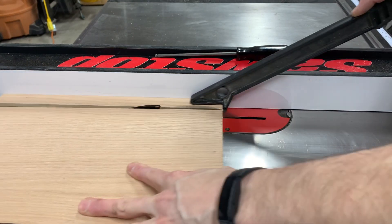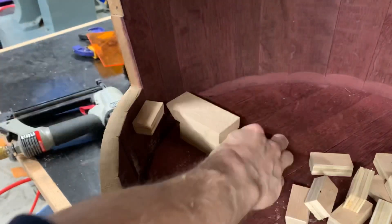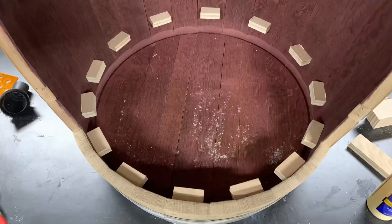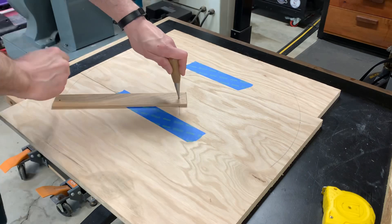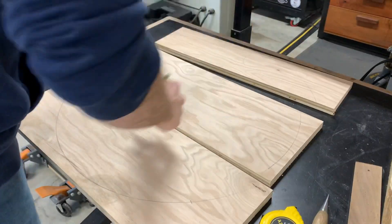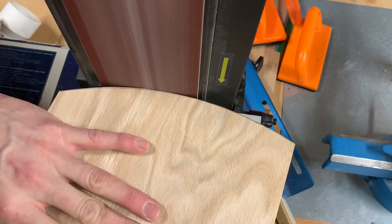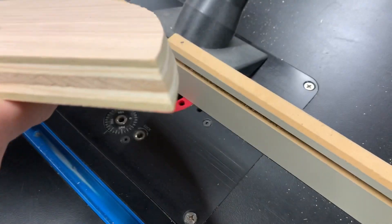Now it was time to trim out the inside of the barrel so I could fit in the cabinet module that I would eventually build. I started by cutting up some strips of scrap plywood with a slight bevel on the edge. I made a little alignment jig so I could install these pieces around the inside of the barrel. These will eventually support a false bottom, so I wanted them all at the exact same height. The bevel is to compensate for the interior angle of the stave. With those in, I measured the interior diameter of the barrel, which is roughly 23 inches. I marked out a 23-inch diameter circle on some scrap plywood — I didn't do this on a single solid piece for a few reasons. I was using up scraps, and more importantly, I figured there was going to be a lot of fine-tuning, and it would be way easier to fine-tune smaller pieces individually than try to make one disc fit. With the router table, I put a 15-degree bevel on the outside round part of these circle sections — this angle is to compensate for the internal curvature of the barrel staves.